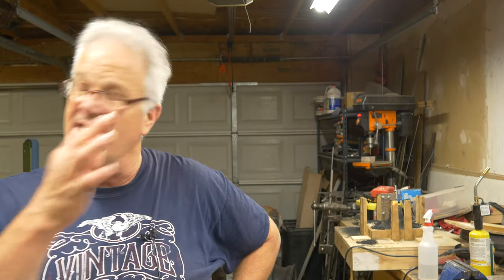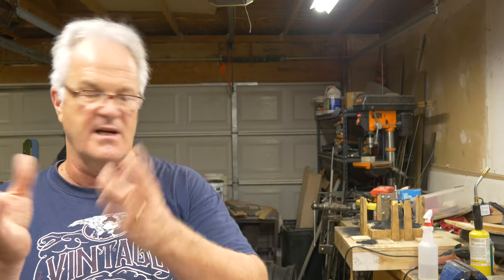The offset pouring basin is actually a great mechanism for a lot of things, right? First of all, for those people that tell me, oh, I use a big conical, I use a can and I use the conical basin because my aim is terrible. Well, you can make a big offset pouring basin too, and you can pour into it. And I'm going to make a big one in my pour here just to show you. You can fix it by a couple of other things, and we're going to talk about that when I do the pour.